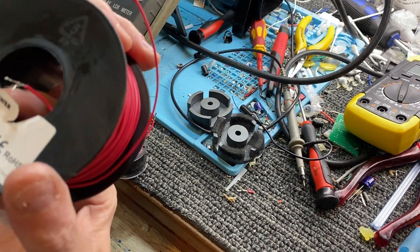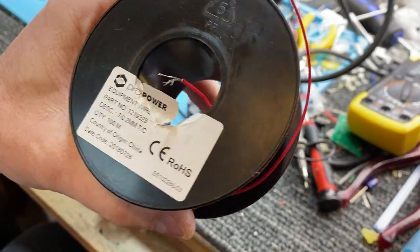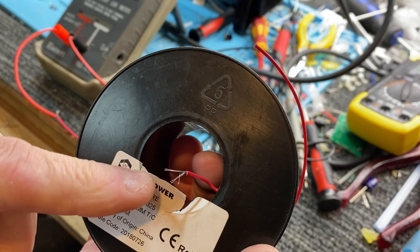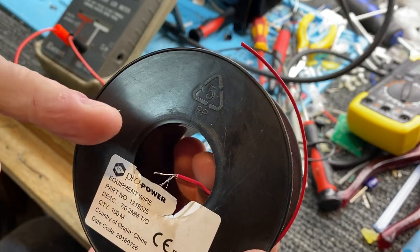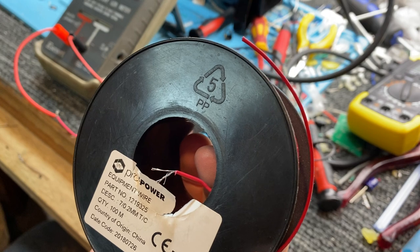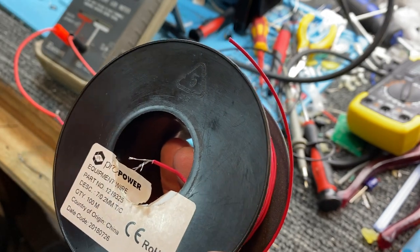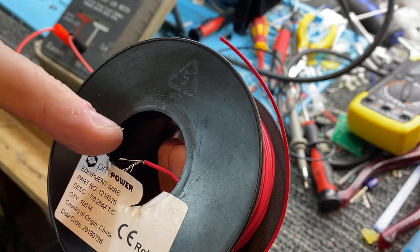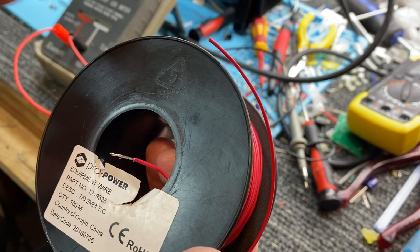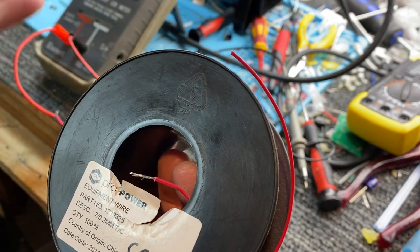This is tin-plated copper wire. I make a point of saying it's tin-plated — you must use tin-plated, because the tin offers a little bit of resistance strand to strand. So when you energise the coil, which you make out of this stuff, it burns off the eddy currents in the receive cycle. You don't want this acting as one big piece of large-diameter solid metal, because it'll desensitise the receiver. The decay time will go into the receiver and it won't pick up anything.